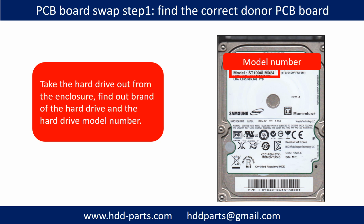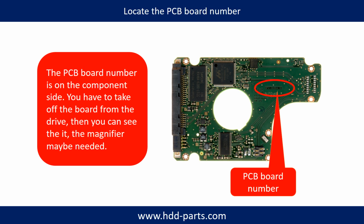PCB board swap step 1. Take the hard drive out from the enclosure, and find out the brand name of the hard drive and the model number of the hard drive. Locate the PCB board number. Different brand name, different model number, different PCB board. The PCB board number and the location are different.